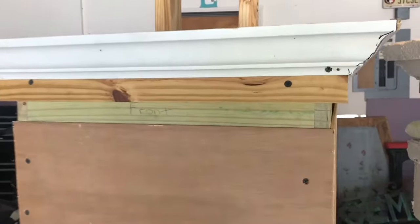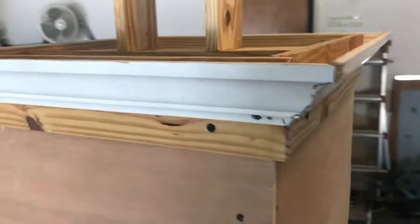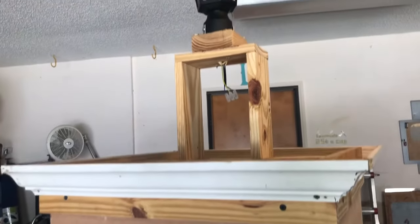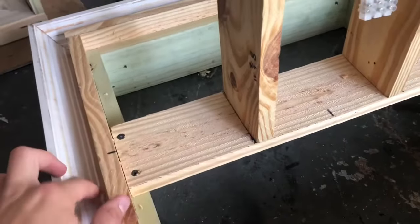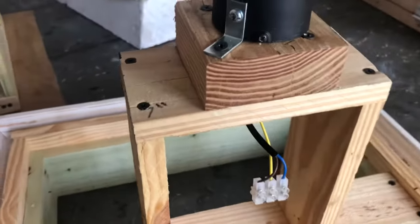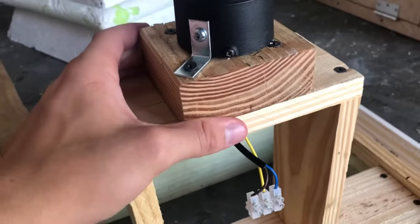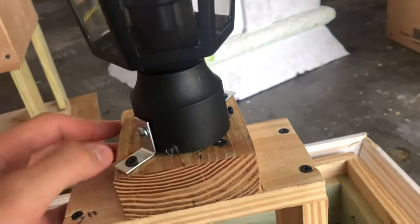This is the top section of the column — at least the wooden part of it. I made a box out of 1x4s that is the same size as the column so that it sits into that lip, and that's surrounded by another layer of 1x4s. The crown molding was cut to go around that, and a big piece of foam is eventually going to sit on top of that crown molding with some other details. This is the structure for the lantern to sit on: I started with an 18-inch 1x4 in the middle, two vertical 1x4s at 8.5 inches in height and 7.5 inches for the top part, and then a 2x4 cut to a square in the middle. The lantern sits on top of that, bolted in with two brackets on either side screwed into the 1x4.